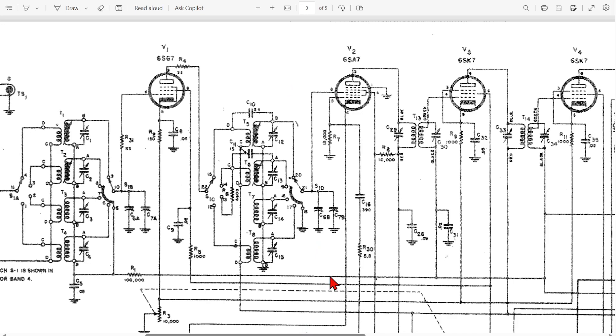For instance, one of the power resistors in this radio that I replaced — one of the big ones — was specked at 10,000 ohms and measured 18,000 ohms. That's a huge drift, and replacing a resistor with that much loss would be a major performance boost. I already know that R4 in this radio is measuring 27 ohms, which is outside the 10% tolerance of its nominal 22 ohms, and when I replace it with a proper 22 ohm resistor, I'm going to get a bit of a performance gain.